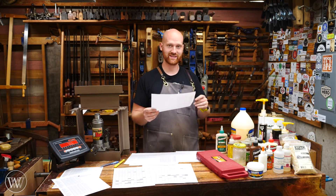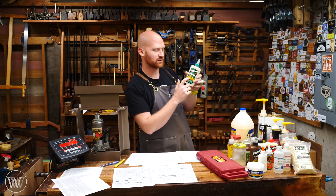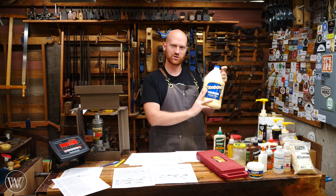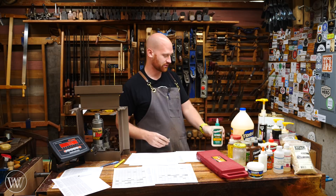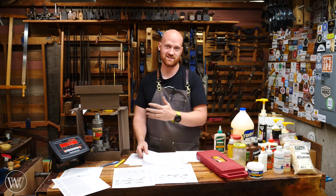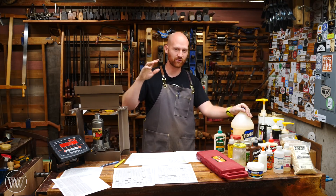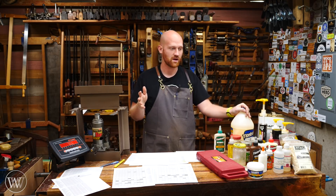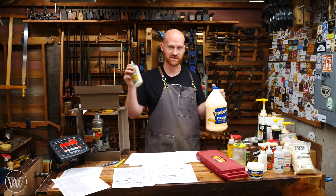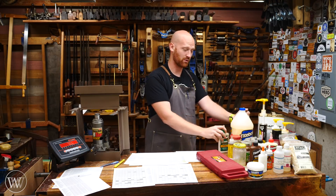Let's dive into the outside glues. I have always thought that Titebond 3 is the outside glue — it says waterproof. And Titebond 2 says water resistant. Unfortunately, Titebond 3, Titebond 2, and all the PVAs basically failed — most blocks broke off before they even got to the test. To be honest, it was a rather brutal test because they were sitting outside through several freeze-thaw cycles, getting wet, getting snow, getting frost. In most of the blocks, they fell off before I could even get them inside to the test rig.